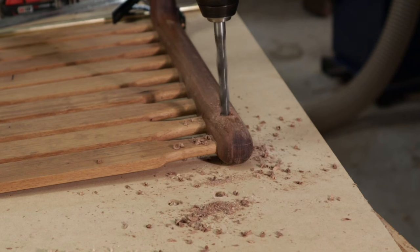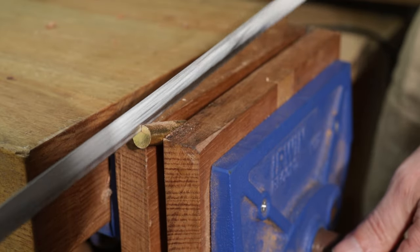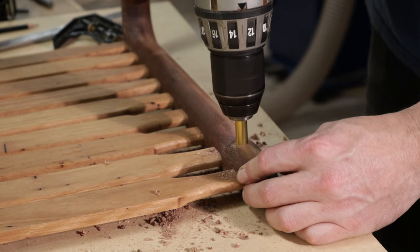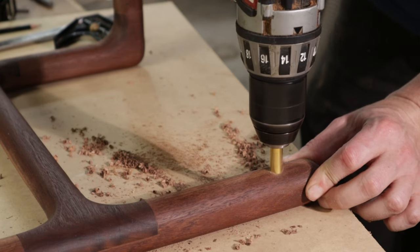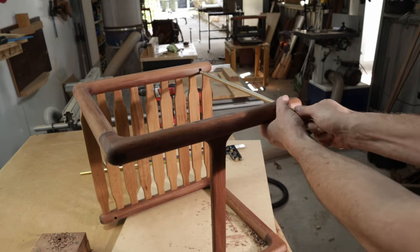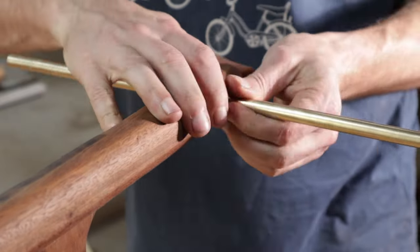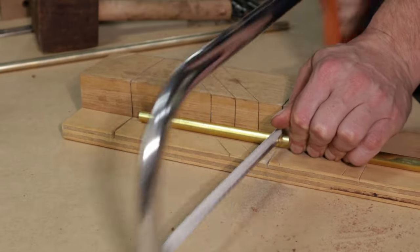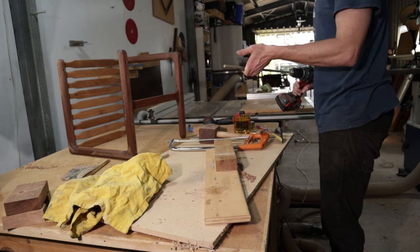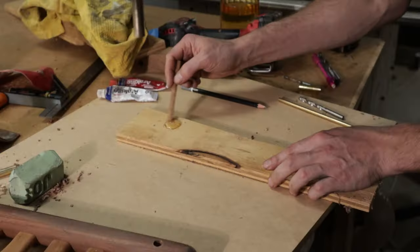For the underside I'm just eyeballing it as this hole doesn't have to be that deep. The brass rod was a bit of a tight fit so I used a short length of that same rod to make a little reamer, which leaves me with the perfect fit. I wet sand the brass from 400 grit up to 1200 and then use some polishing compound on a bit of leather to finish it off.